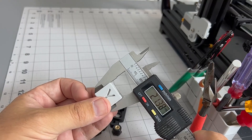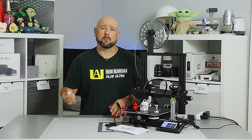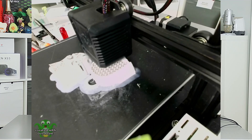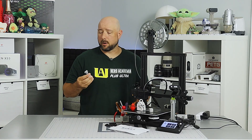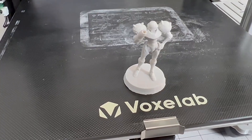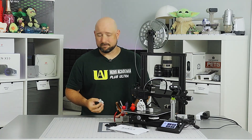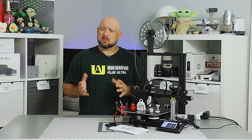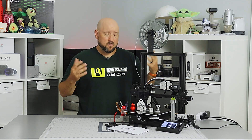The calibration cube came out great — just a couple hundredths of a millimeter off in X and Y, a little more in Z, but most of that is down to first layer tuning, not stepper calibration. The Mandalorian trophy did not disappoint — the skull features look great save for a little under-extrusion at the 1.0 multiplier. Baby Samus is a real pain on FDM with small details, overhangs, and tiny joints — it's more of a slicer and filament stress test — but without a well-calibrated printer those settings don't matter, and the Samus came out great. Over the course of the week I did not have to readjust the bed level after the initial leveling, which was a pleasant surprise given the single Z stepper.